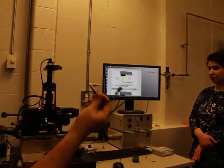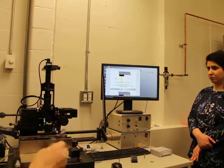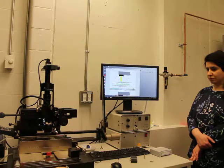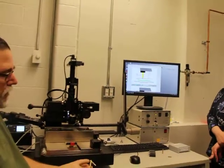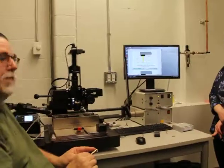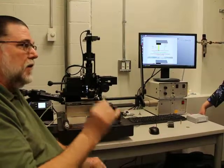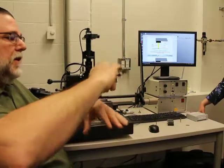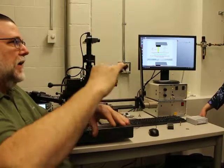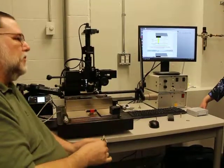If I was to use a 1 millimeter die, it's not going to work because my 22 is not going to be right. So whenever we make up a tool, if we measured from this point here to the face of the tool, it would be 21.7 millimeters. Then when you add the 0.3, now you get your 22. That's very critical because if you're trying to place with precision and you're not coming down flat or square, it's going to hit on the heel or the toe first, and when you release it, it's just going to kind of free fall, and you lose your alignment.